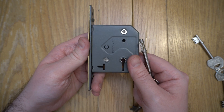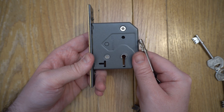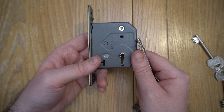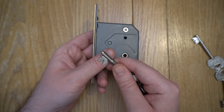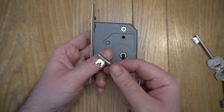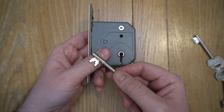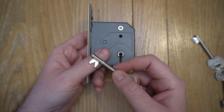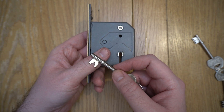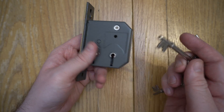Welcome back. I'm just going to do a quick video explaining what these are — lever locks. Now I quite often see these confused with warded locks. A warded lock takes a key with a bit on the end that has a shape cut into it, which just allows that shape to pass through an aperture to move the bolt. The problem is you can put something smaller than the key into the lock and unlock it. So warded locks have got problems. These are not warded locks — they're lever locks.